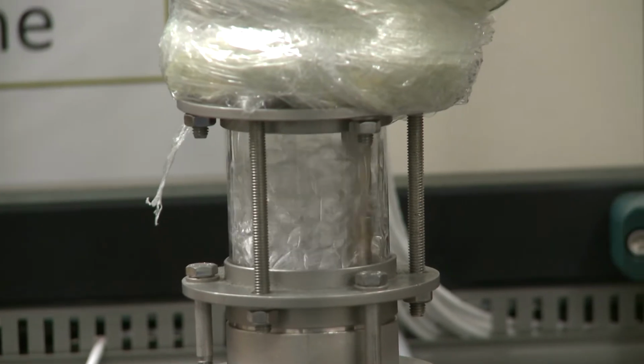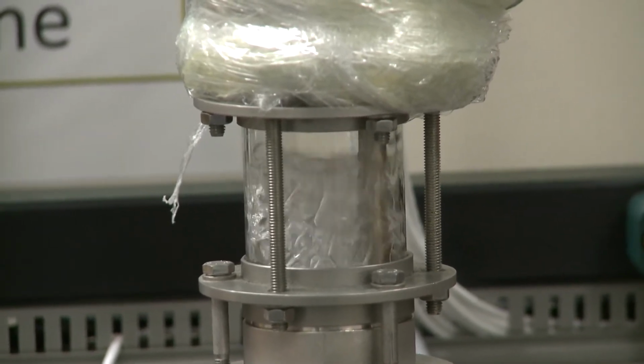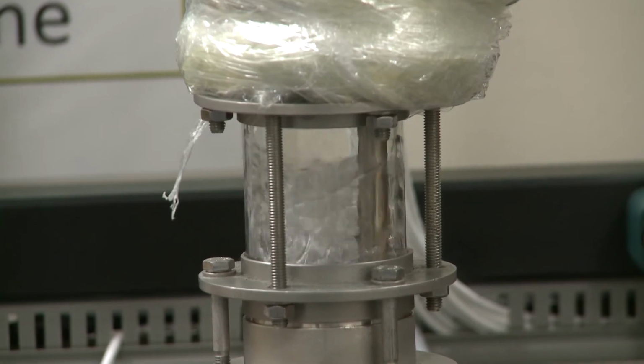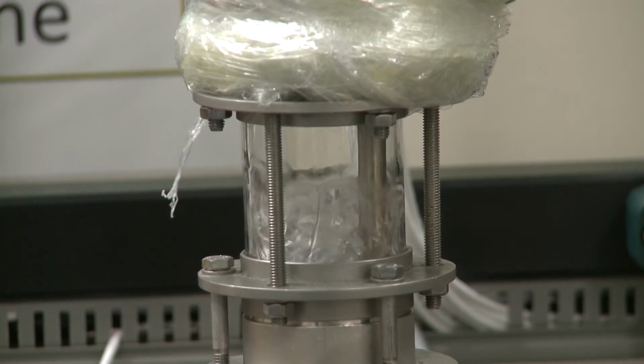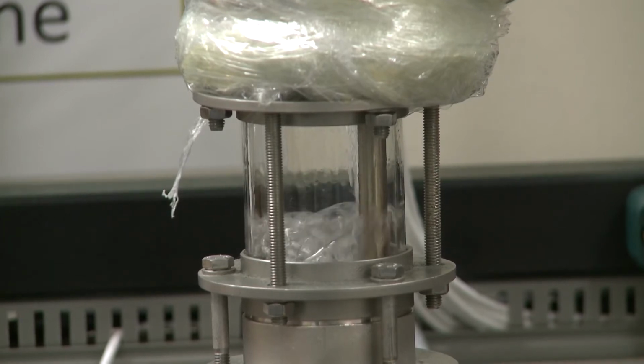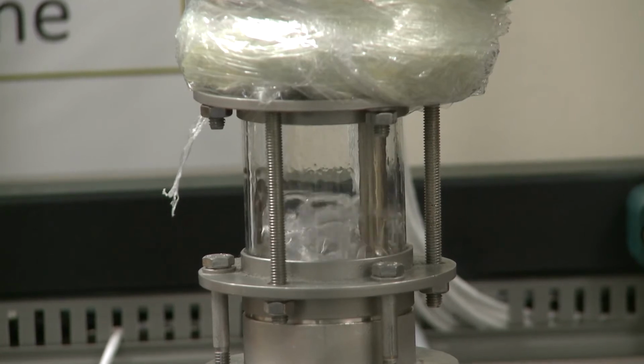So we're at the other end of it here. Essentially, all that liquid is falling through the column rapidly and flooding these trays. It's okay for now though, right? What we're doing is waiting for the column to respond to our recent change in power. And you can see already the trays are starting to drain down into a more reasonable level.